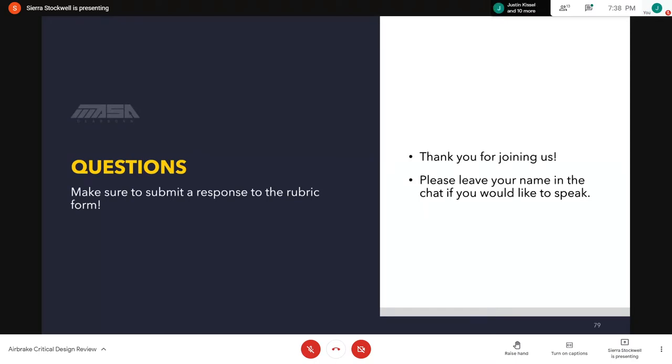Yeah, at least on the electrical side, that would be very easy to do. Could do a 3D printed capacitive sensor or something. Even without that, for testing the mechanical portions of it, that might be a good idea. But if we just want the electrical delays, it would be super easy to set up a simple data logging system where a signal is sent out over a wire when the data is received and processed on one end, and when it's transmitted from the other end, we hook it up to the same system, and the delay over wire is practically nothing, so we can discount that. We do have the option to have an external Ethernet link, so we could even integrate the entire simulation into MATLAB and have that all logged and monitored.